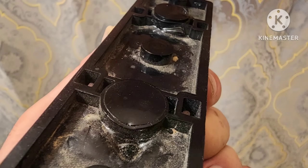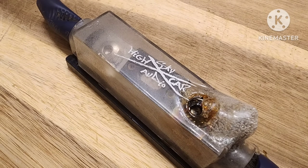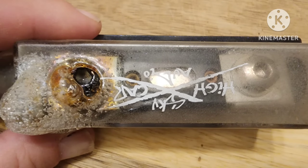There's no coming back from that — you've got to tighten it up or it's just going to get worse and worse. The funny thing is a fuse will not blow from heat. You can melt this thing down into a puddle and it will still be conducting electricity. The fuse will only blow from being over-currented, so your fuse is going to melt into a puddle and not blow because the fuse isn't the problem and your current isn't the problem — a loose connection is the problem.